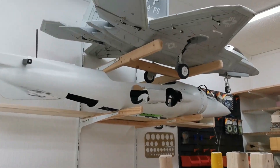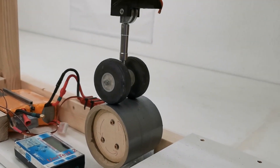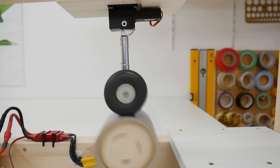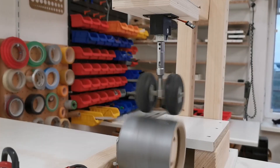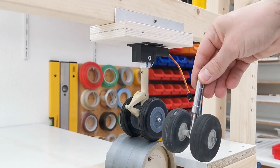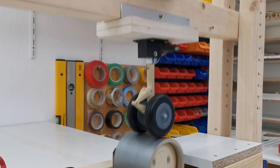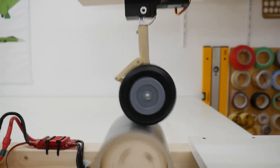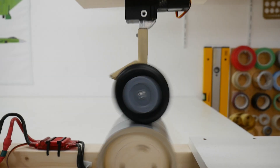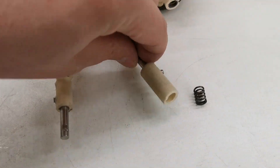Next is the Harrier main landing gear, also from the big Harrier — made from aluminium with two wheels. We go up with the load to about four kilograms. Next is again the Harrier main landing gear, similar to the one before but printed in AF80, now with one kilo on it. This also broke right there.